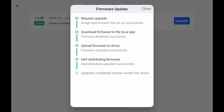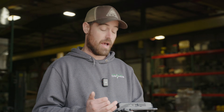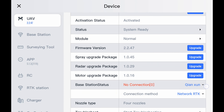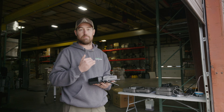Our upgrade is completed and it's prompted me to restart the drone. If this was the only upgrade you were doing, this would be the time to restart the drone. Since we know there are going to be other updates, we're going to push those before we do a final restart. So I'm going to close that. Next one down is going to be radar package — we're going to select that. Again it says 'latest' and not 'current,' so that means we need to upgrade. We know there's another firmware to push through. So we'll go ahead and close that one back out. Now we're going to go to motor upgrade package — again it says 'latest' and not 'current,' so that means we need to upgrade from there. We're going to walk over to the drone and confirm that the exterior battery is shut off.